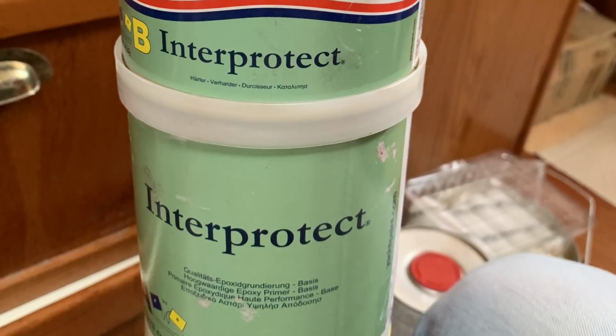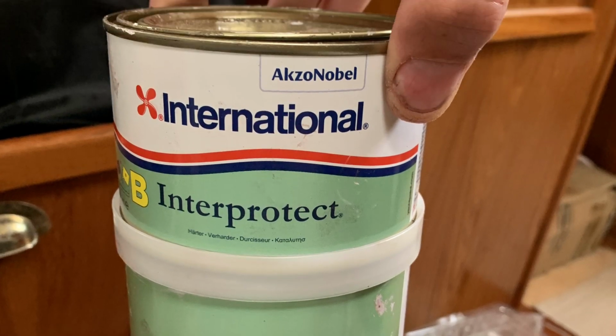So the sheet metal was in, that was actually done quite quickly. I think it was the third day, and then the only thing left was painting it. So on the outside it was quite okay because we used Interprotect. It dries in, I think, 6-7 hours, and then you can repaint it again. But on the inside we needed to do a Sigma paint, which was especially for water tanks. It needed a special grounding, and then it needed this bluish goop.